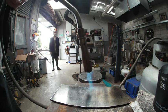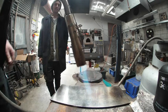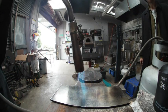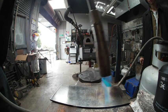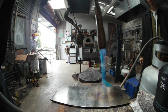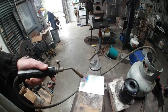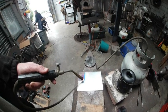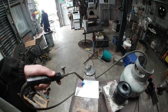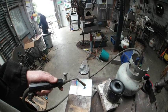It's taking a lot longer with the thicker steel. I don't have the control yet to get all the temper colours in there, but I definitely like working on the anvil — it slows the process right down. What I'm trying to do now is push the blue through the whole piece and try to get a more even colour.